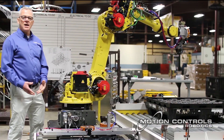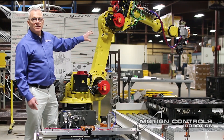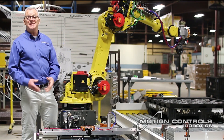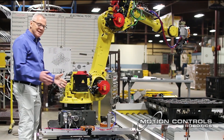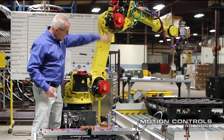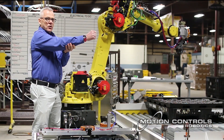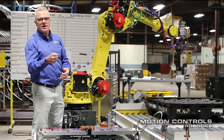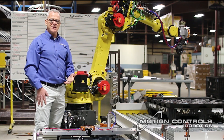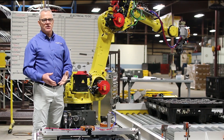This is the same robot model as the first one we looked at — still an R-1000 — but this one is an R-1000-80F, which is typically a floor mount robot and six axis. We have the base axis, waist axis, and upper arm, but in this case we have three wrist axes: roll, pitch, and yaw, just like your wrist. The only real difference between this robot and the H robot is five axis versus six axis. The preventative maintenance and controller maintenance are the same, just with one additional axis.